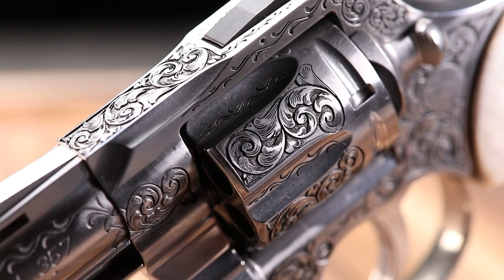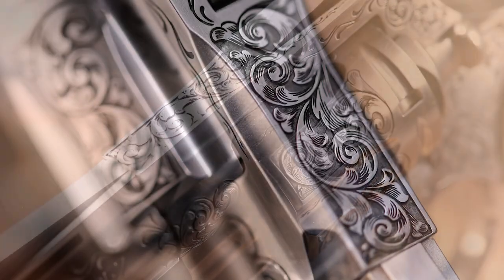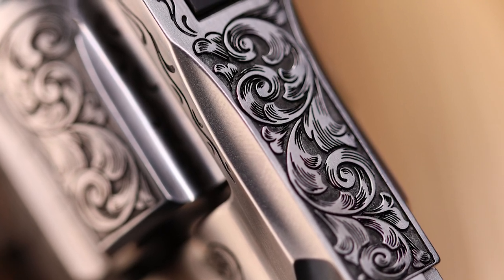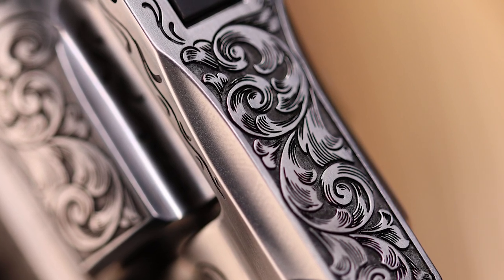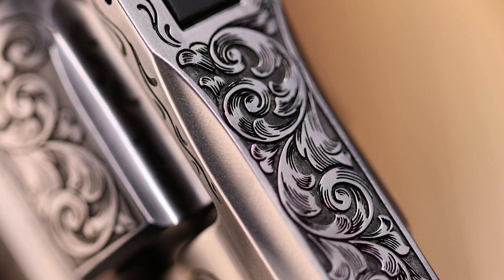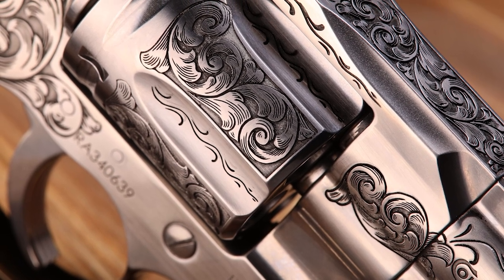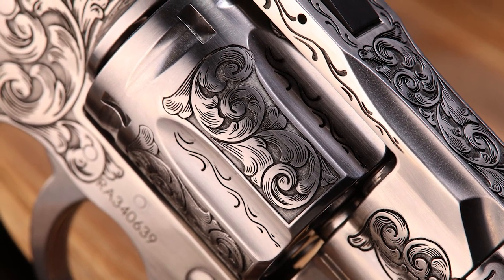The hand chase process: once it's finished cutting, we go back in and basically recut through the whole pattern by hand. That cleans the pattern back out, and then we go back in and blend as needed. Sometimes we go back in on certain projects and ink the background, which brings that color out. After we're done, we seal it with the same sealer we use on our color case or blued guns — at that point it adds a 650-hour salt rating and UV protection, so it basically protects it forever.